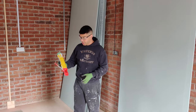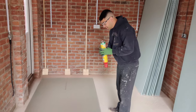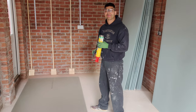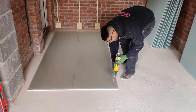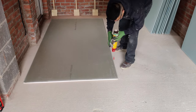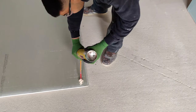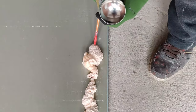So that's the idea. So we've got this pseudo plasterboard adhesive foam. It's meant to be quite straightforward. So this is my first attempt. If it goes all wrong, here we go. Right. 3 centimeters from the edge is supposed to do it. Right, there. Comes out pretty seriously.